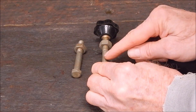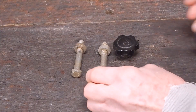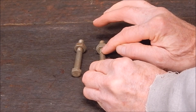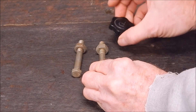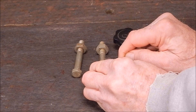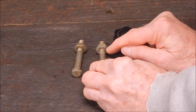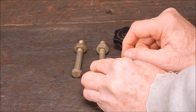I'm going to use a couple of UNC bolts because this is UNC thread in the Peerless knob that screws on. I just have to weld these nuts onto these bolts, and that way you can put your tab in and screw your connector knob on. You could do this with stick weld but it would be pretty horrible, and you can't slide the nut right up against the face of the female section because you'd have a big ugly weld there. This is where bronze brazing comes into its own.